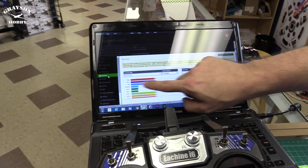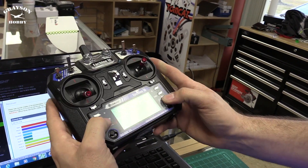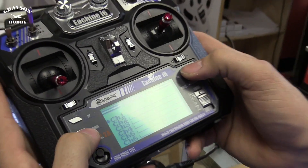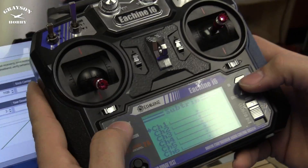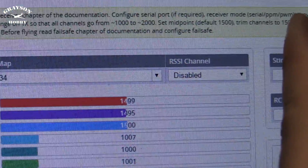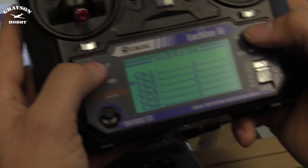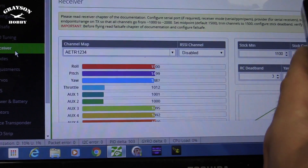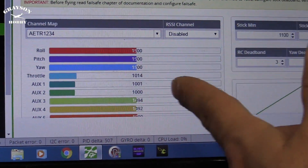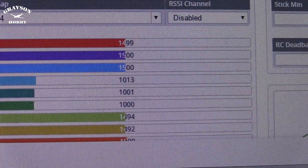Once we've got that, we need to go into the sub-menu and center the trims. Right now the quad thinks we're going left and backwards. Let's start with roll — we're gonna go into the menu. Turn it off, turn all the tabs, go to Setup, then Sub Trim. Channel one is roll. Go either up or down — you'll see the number. We're at 1500 now. The second one is pitch — channel two. Channel three is throttle, which we shouldn't need to adjust. Let's get channel two to 1500 as well. If it jitters back and forth a little bit, that's okay — just don't want it going too far off. Got 1500 there.